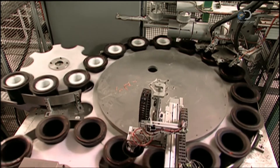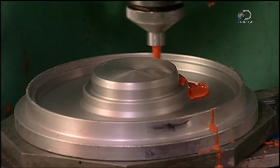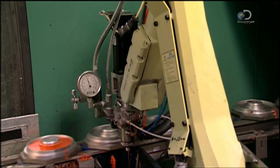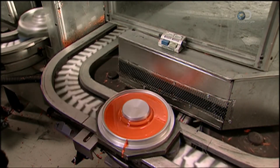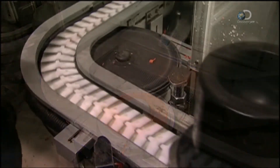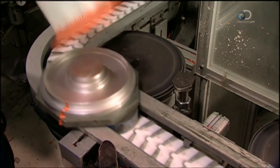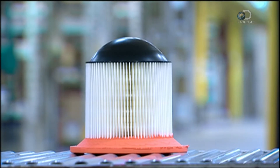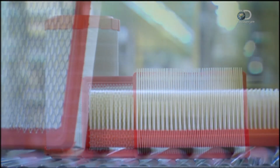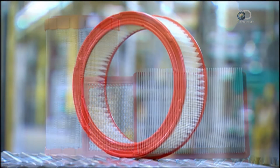The wheel pushes the paper-filled moulds onto a conveyor belt. Down the line, a robot pumps a polyurethane mix into the bottom mould for the filter. A worker then presses the paper-filled top mould onto it. Heat triggers the chemical reaction that expands the polyurethane, encasing the bottom of the filter paper and forming a gasket that will fit tightly near an engine intake. The radial air filter is now completely assembled, and it's taken just 20 minutes. The air filters are now ready to do some dirty work.